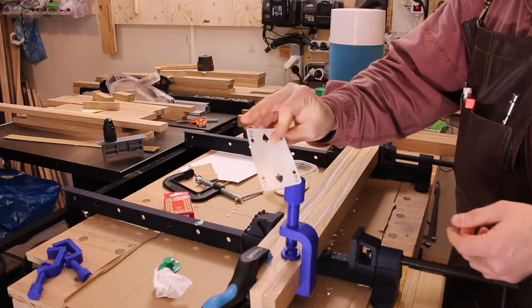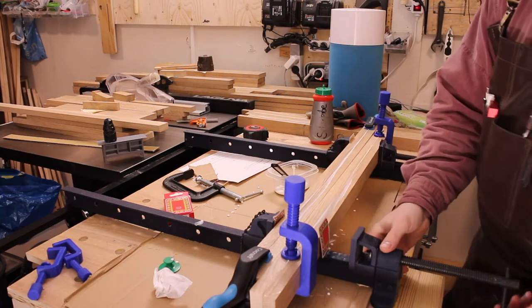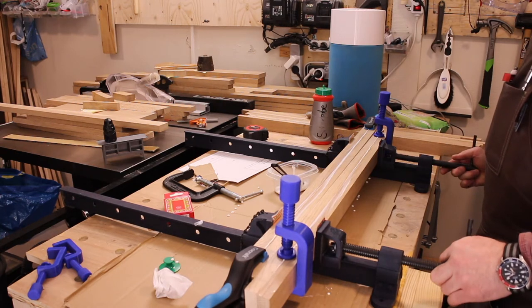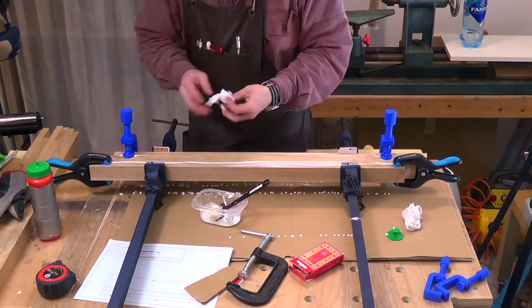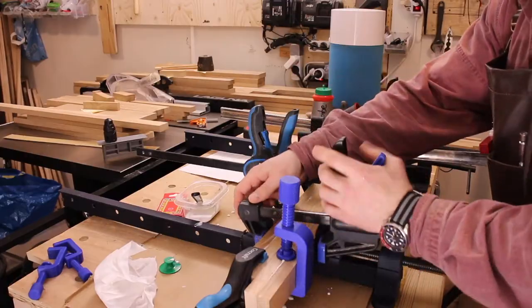The wood glue won't stick to these playing cards, so they work well preventing the sash clamps from marring the wood, and it gives me an upper hand against Baby Vader when we play Texas Hold'em. I may have gone a bit overboard on the glue, and if you don't have easy access to water in your workshop, using wet wipes to remove excess glue works really well.